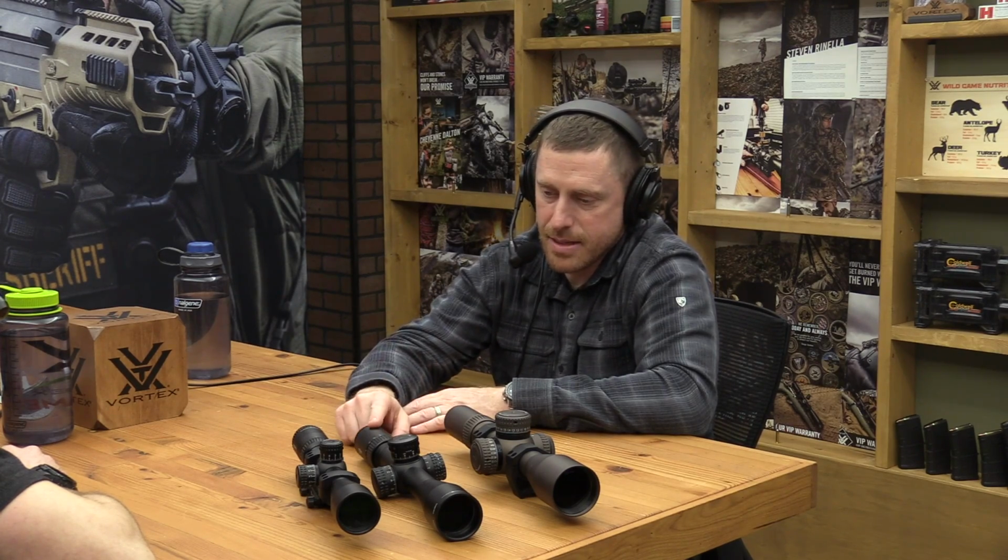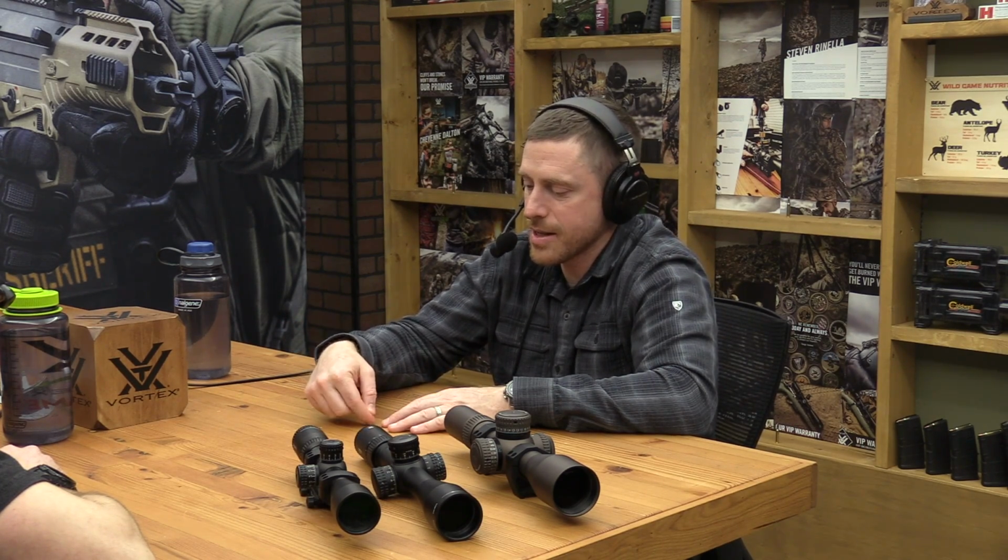This is a milradian scope, so every click is 0.1 milradian. You have to figure out how much translation on this screw is going to equal 0.1 milradian, and it has to be very precisely cut. If that's off by 1%, well, guess what? When you dial, you're going to be off by 1%.